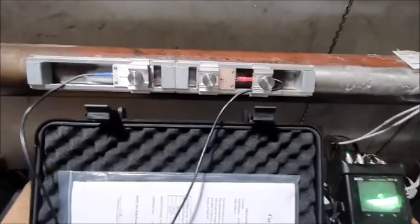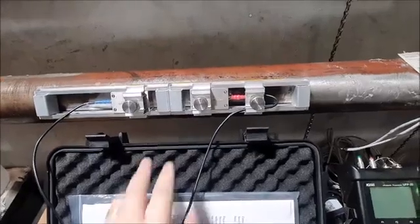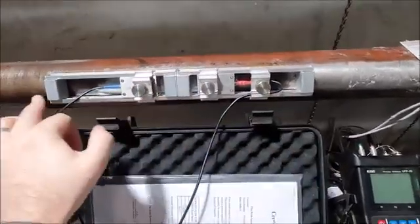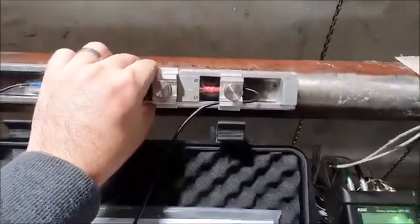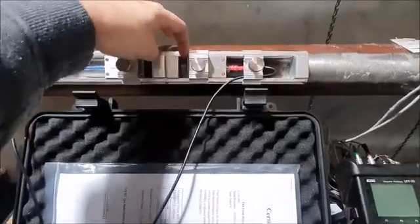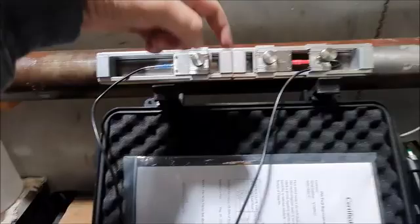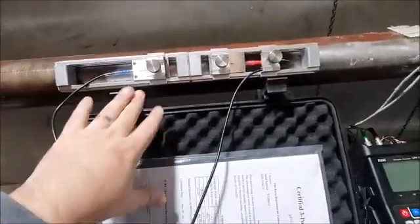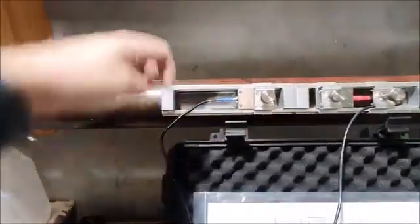There's something else to note that could be important if you're on a larger pipe. Obviously this distance may not cover you for the whole thing, so that's where your tape measure will come in. You just mount your one transducer frame, then you'd need to manually measure the distance with your tape measure from the front face of your transducer. Say you had a big pipe and you needed to space them at 200 mil apart, then you just mount your frame separated, and manually measure your distance with your tape measure just to get that correct spacing.